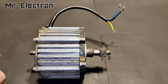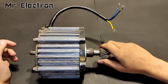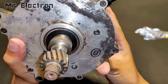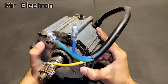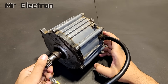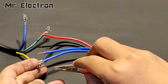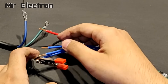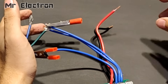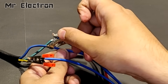This is a 750 watts 48 volts BLDC motor. You might have seen me use this as a generator in a few of my previous videos — it is from an electric rickshaw. BLDC motors contain permanent magnets so they can also be used as a generator, and that generating part is utilized by this controller board as back EMF to determine the pole location. The blue wires are being connected to the 3 wires of the BLDC motor — remember to keep as much space between the wires as possible.